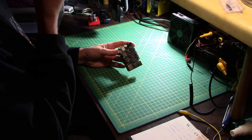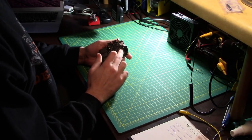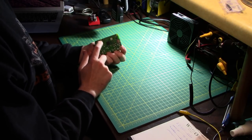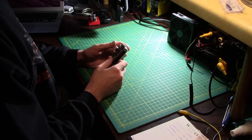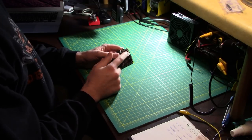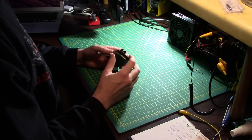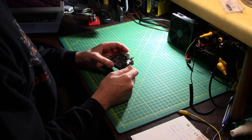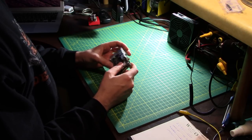There's a 12 volt power connector right here. It goes through a buck converter circuit, and then through the GPIO header actually provides the proper amount of power for the Pi using the same power that your radio takes. Fantastic. There's an accessory port here with a couple of I/O pins and some power and ground and analog inputs.